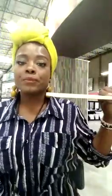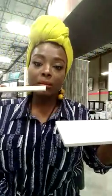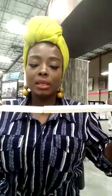So, like marble, a rectified porcelain, as long as it is really a rectified tile, you see that? You can set it really, really close, with almost a non-existent grout line, right? So now we're in 2019. As little grout line as possible is all the rage, right? We're slabbing out. We're continuing countertops up the walls. We're doing all that other kind of stuff, right?